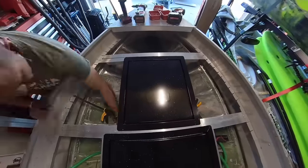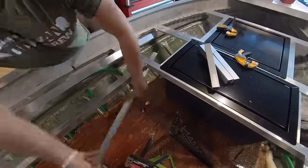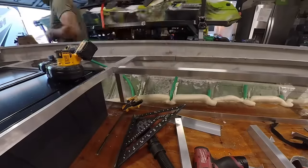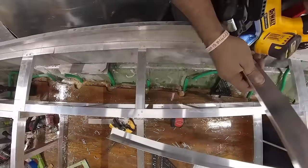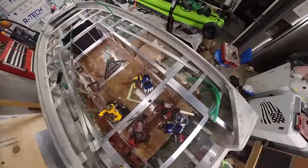For one, because the audience didn't want it, and two, because you can epoxy wood and it actually lasts very long as long as it's not opening and closing. If the wood's just staying there, it does a really good job of just staying there and being present and lasting a long time. You can also just drill the bases of your frame right down to the subfloor with screws and seal them back up with silicone or 3M 5200.